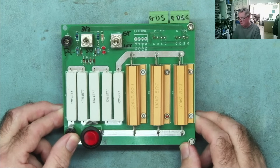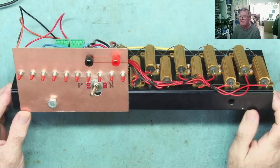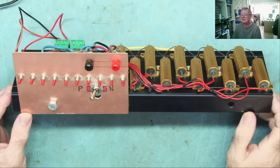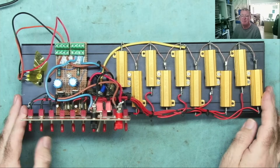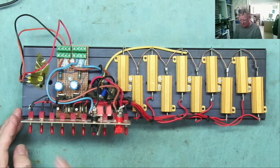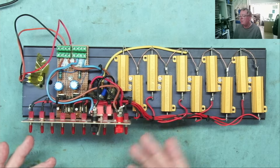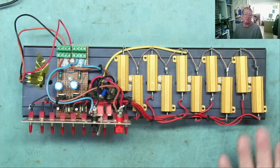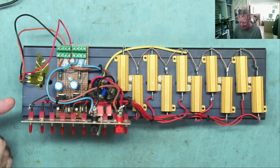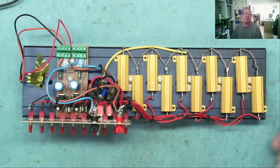Similar to that one was this one — the prototype of the destructive bipolar and MOSFET tester. This actually tests the maximum current you can pass through the MOSFET. You just switch the switches, adding one amp at a time. If the MOSFET fails before it reaches its rated current, it's fake. It will destroy fake MOSFETs — they will go open or short circuit. The same with transistors, N-type and P-type. If it withstands the current up to the rated level, it's fine — it only kills fake ones.